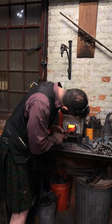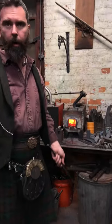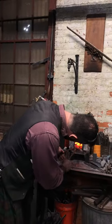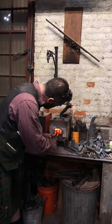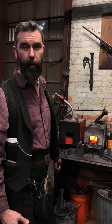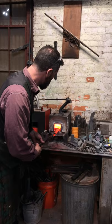And also I would like to use the files to show the hardness variances from one end to the other, because it's surprising how small those adjustments are. Relatively, we're looking at the difference between 600 degrees and 200 degrees, and the hardness differences are often less than 10 points on the Rockwell C scale. Really close.